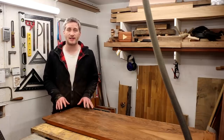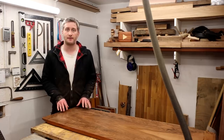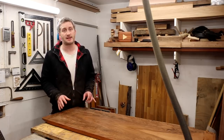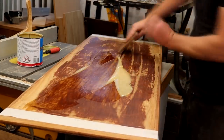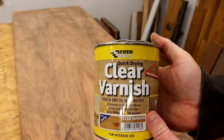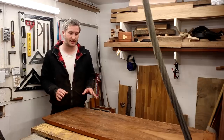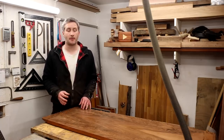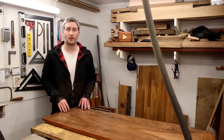In this video I'm going to try and tackle a project that I previously failed on — the repair and restoration of a mid-century style coffee table. Everything was going well up until the point when I added the veneer. I chose to use contact adhesive, which in hindsight probably wasn't a good choice, and when I applied a water-based varnish finish to the tabletop it caused some bubbles to appear in the veneer. Many comments suggested the water-based finish was probably where I went wrong, as it may have swollen the wood veneer in certain areas creating the bubbles.